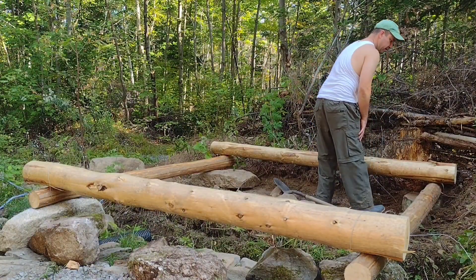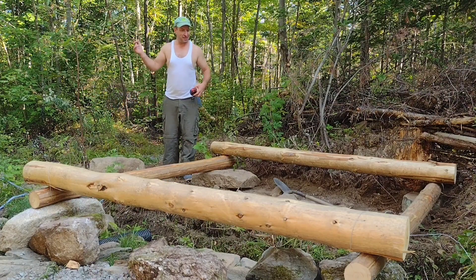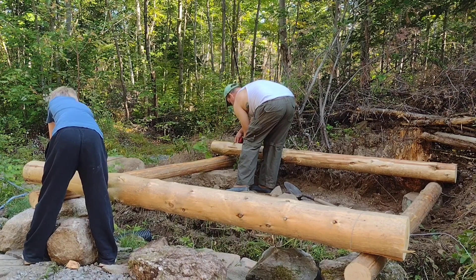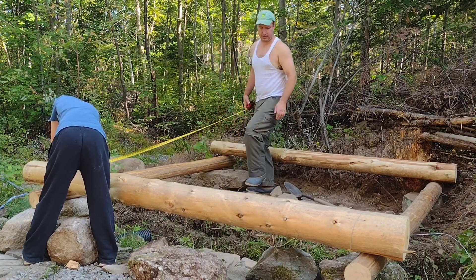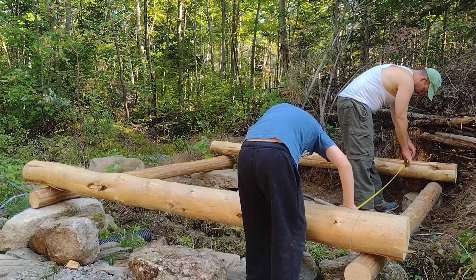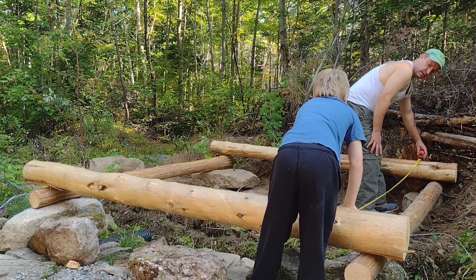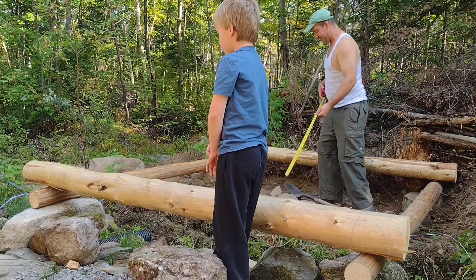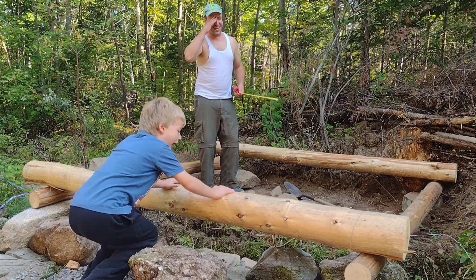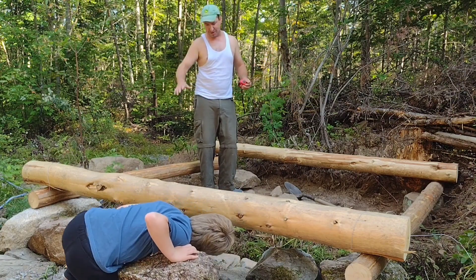Come on over — you've got to hold the measuring tape here for another measurement from there. Now we're at 80 inches. Let's go this way — we're going to try to get a similar measurement over here. 79. I want to say right over there — we got it. Now the hardest part: we have to get the diagonals to line up. Once the diagonals line up, we know our structure is square. We're going to wire it all together, maybe even spike it, and then we'll start our project from there.